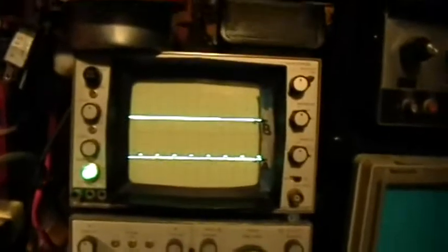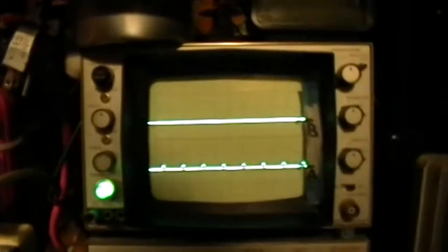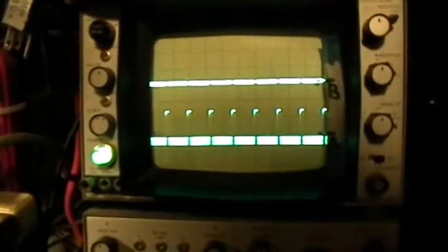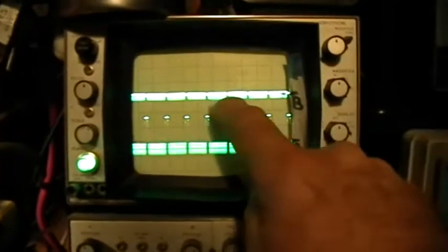And what I want to illustrate here is something else. I'm going to make just one small error, and then I'm going to turn up the amplitude again. And I think you can see that I still have plenty of nice oscillations in the current viewing trace, but there's no current indicated in the between times. We're still topping out at around 7 or 8 volts on the clipping of the gate trace, but the current viewing trace has oscillations with no current shown in there.